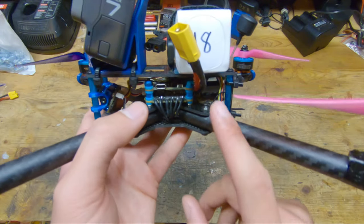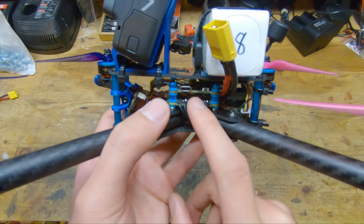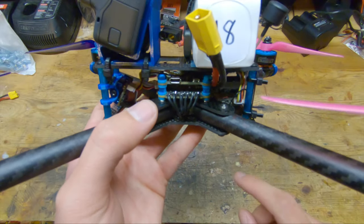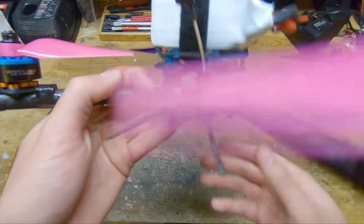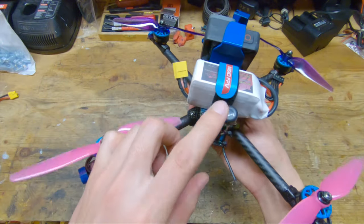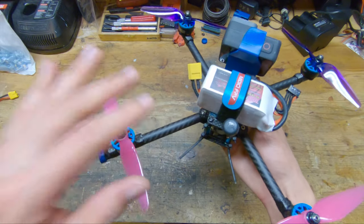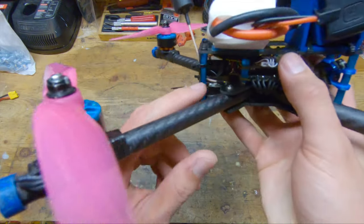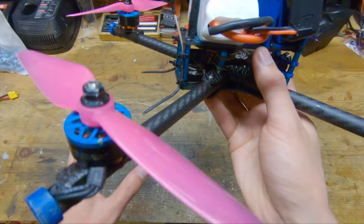The only electrical concern I have with this build is that I'm running this transmitter directly off of the flight controller's 5 volt, which might overstress it, I don't know. Attached to the video transmitter is the TBS Dum Dum. You may know it by the name of the Triumph Pro, and that has a UFL connector that plugs directly in to the video transmitter to save weight.